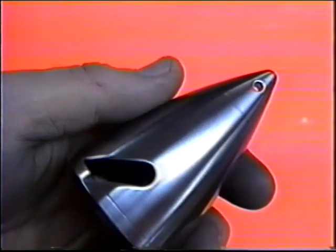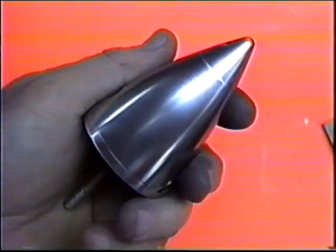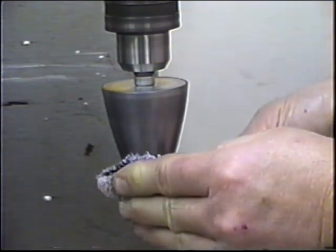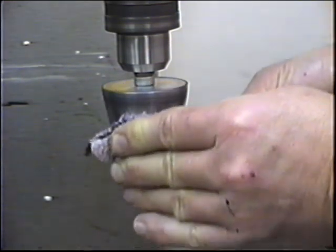Now, after that little trip to the drill press, almost all of this, well, I'm not sure. I'm going to try this a little different. This is the stuff we were using the other day to polish. This is the 2000 grit. Let's see if it brings it up. It might be a little premature to go to 2000. I think the last little thing is get all the scratches out, and after that 2000 grit, old Gorhams. One thing I love about Gorhams, you try all these exotic things and you wind up in the end doing the polishing with Gorhams.